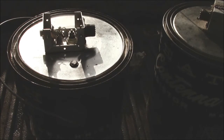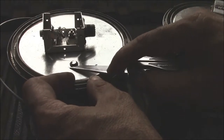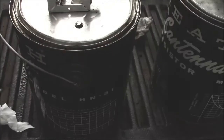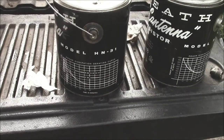On this side it's a snappy little relief valve — all it is is a spring and a washer — just in case the dummy load gets warm and gases off a little bit. These things can be kind of messy; they're full of oil. These are probably full of mineral oil. You'd have to find a pretty old one of these to have any transformer oil with hazardous chemicals in it, but be aware. There are some synthetic oils that are older.